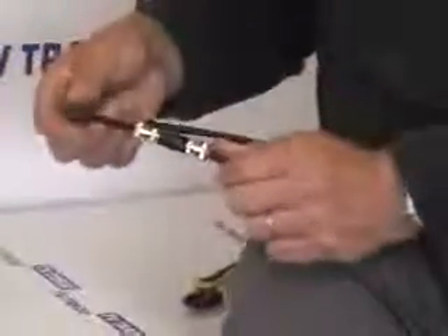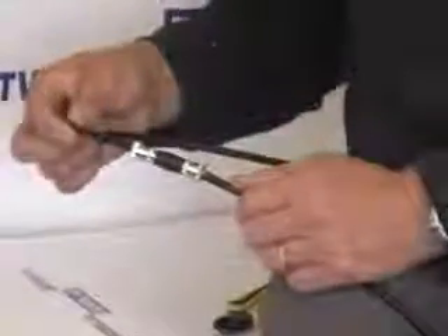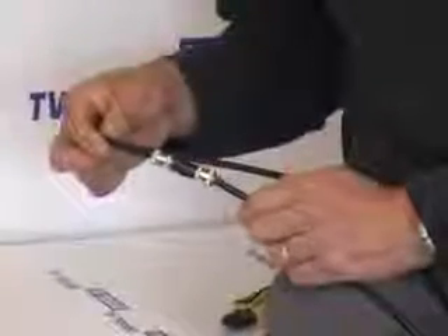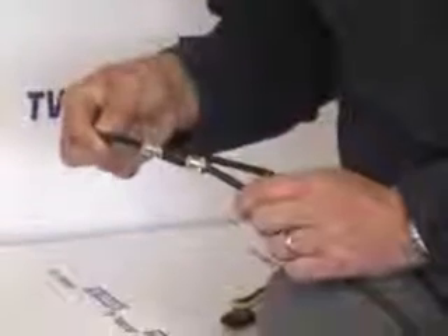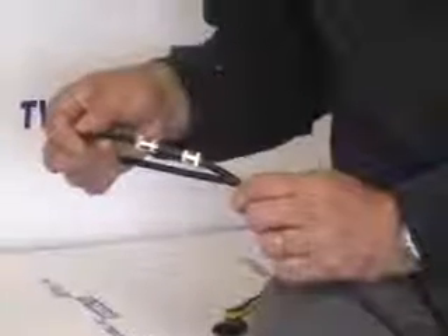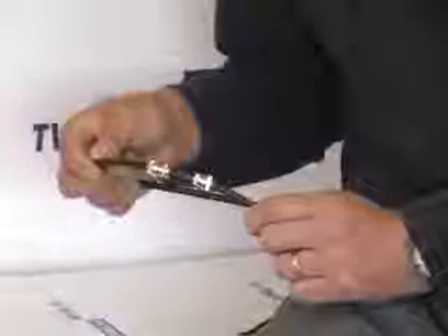It's not ideal — it's possible but not ideal — to use this for transfer of a digital signal such as with a satellite system, because an F type joiner with an F type connector will give a much superior join. But used in the right manner, this can be both a practical and useful connector, and that's how to successfully join two coax connectors with a barrel together.